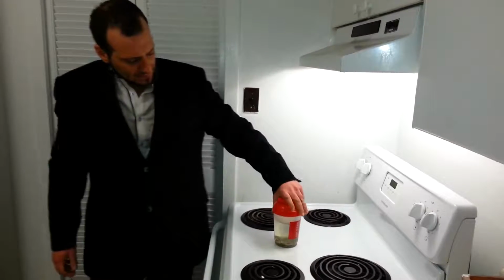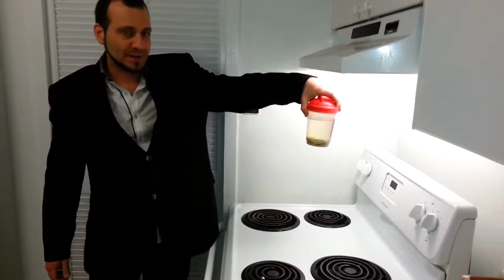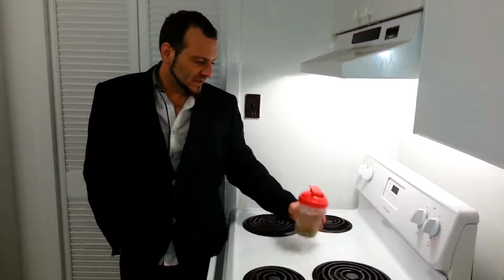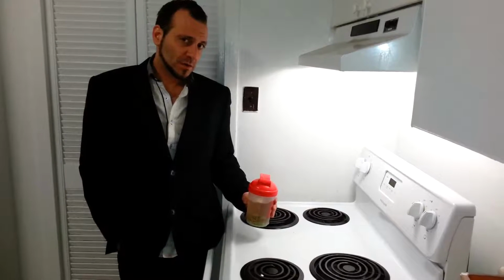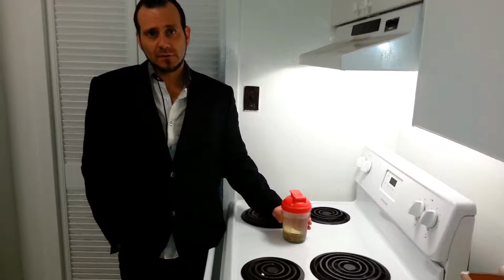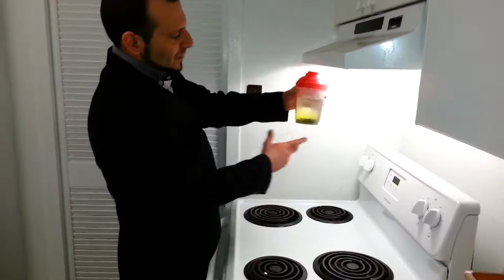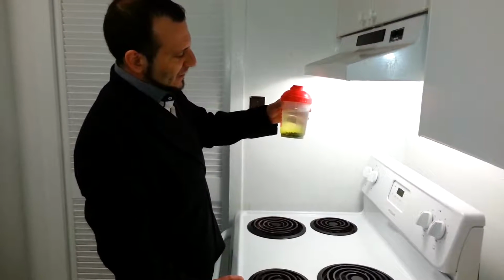Okay, so now we got about 8 ounces of muriatic acid, 8 ounces of hydrogen peroxide. We have something here called poor man's acqua regia. Acqua regia is basically the solution the Italians used a very long time ago to strip away gold from other alloys. Some copper, some brass, whatever the case. If you can see already, it's starting to turn a little bit of a greenish color. That greenish color is actually the green copper on those fingerboards that's reacting with the acid.